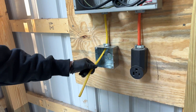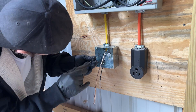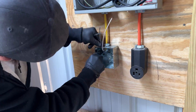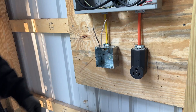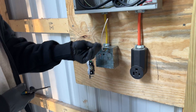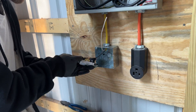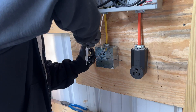For the outlets, I'm going to start by stripping the wire back and cutting off everything we don't need. I'm going to put in the ground screw and move the hot and neutral out of the way, then wrap the ground wire around the ground screw and tighten it down. Now I'm wrapping the ground wire around the first receptacle's ground screw and tightening it down, same as I did at the box's ground screw. I'm going to be doing this with all the wires for the first receptacle.